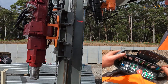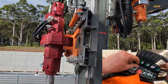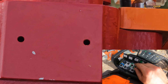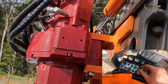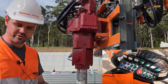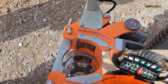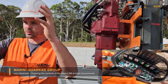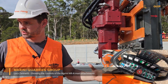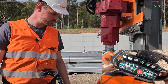One more thing I didn't show you before is the side shift. You activate it with this one. The side shift is used basically if you're lifting your anchor bar with the winch - you're pulling up your anchor with the winch, installing it, and then once you're finished you slide your head back in and you're ready to go. This is important especially if you're dealing with casing: you're not leaving your hole, not losing your direction or angle. Without this, you'd have to lift up the mast, move aside, put the anchor, then go back and get the casing. With the side shift, your casing stays clamped with the lower clamp here - slide, pull your anchor, slide back in, grab your casing, go out. And that's it.